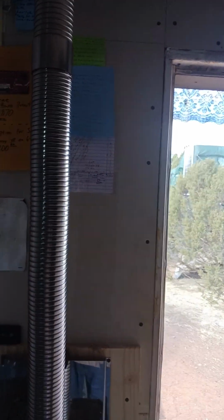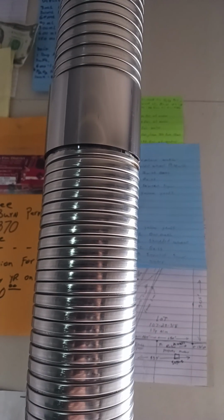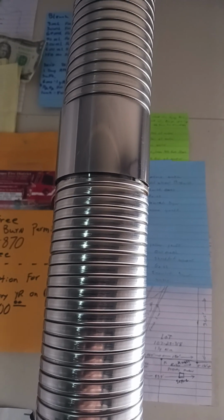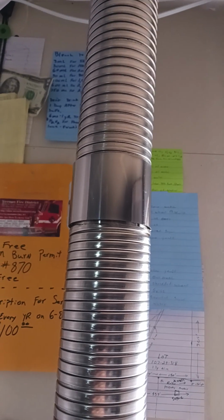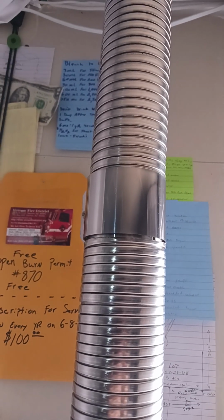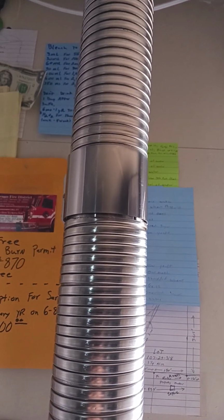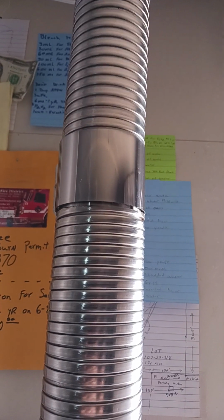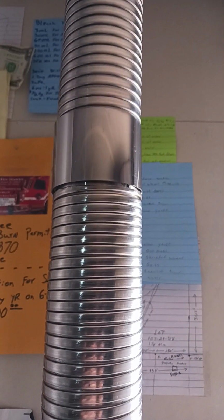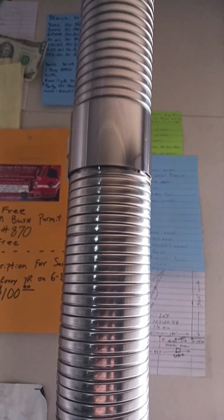Plus it has its own. Now behind this there's another clamp. There's a bunch of little spacers also in here, wire spacers. But behind that clamp there's the inner pipe, which is the exhaust. I had to put flue duct tape, metal duct tape, around it. It's high temperature metal tape, and then I clamped it. That way I wasn't getting an exhaust leak.